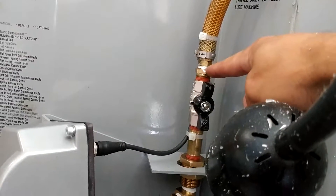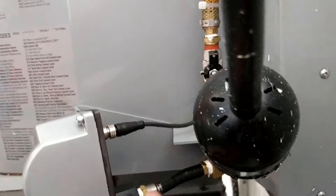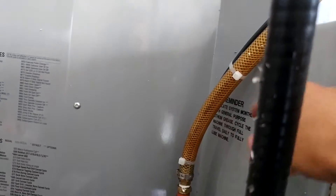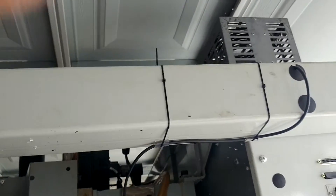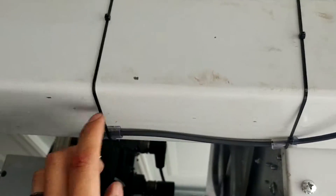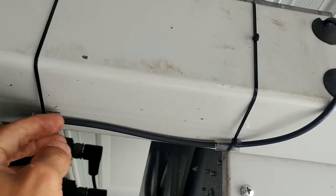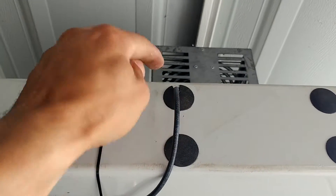Then I put the short tube on, the on/off valve, and the adapter, and then the actual coolant hose that came originally with the machine. There's also a small wire here that I run — I used zip ties, wider ones that were supplied. I ran it up into the top portion of the machine using the two black ones supplied, and I put little pieces of rubber hose around the wire so in case it rubs, it's rubbing inside the rubber hose.